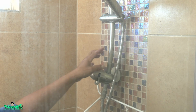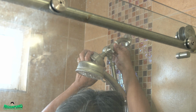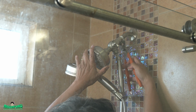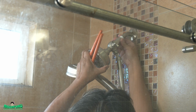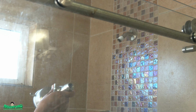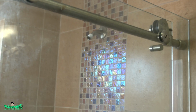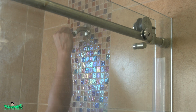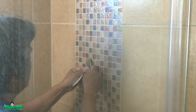Right, so this is already loose. It's been leaking water. That's why I'm replacing it. I even put the Teflon over there. It's still leaking. It's easy. Now I just need to remove this one. Remove that one. Sorry. And put new tape. Take the old one out. If you have a scraper, use the scraper, not this one. Oh, okay. That was easy.